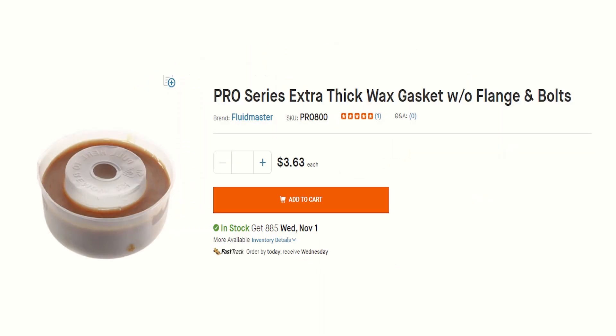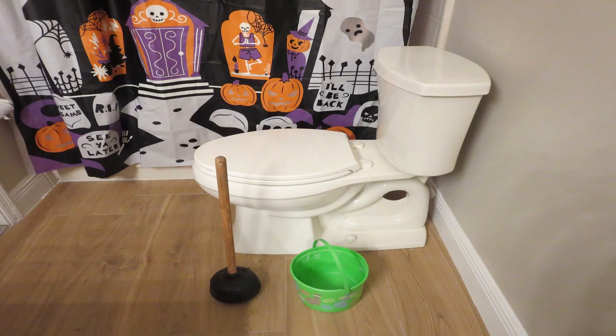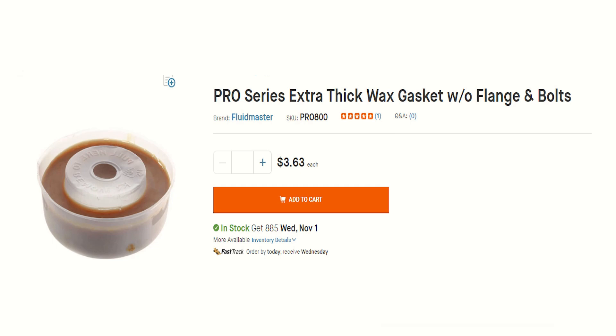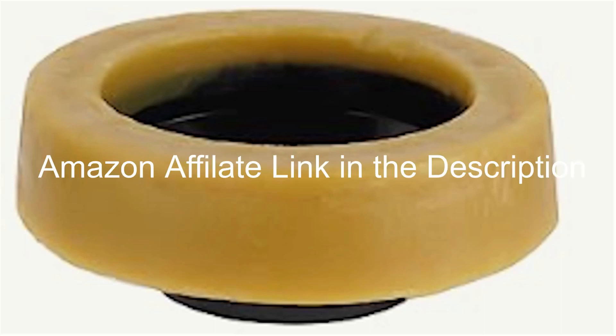So I replaced the wax ring — I'm pretty good at replacing them nowadays. I have a video on tips for how to replace a wax ring; you should watch it if you haven't already. It takes me about 30 minutes. You should be careful using a plunger: on a toilet it could damage your wax ring. I have a link in the description for a wax ring I recommend. I don't recommend the wax ring from Home Depot with the plastic retainer funnel on it — the plumber I watch says those break down a lot.